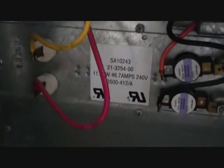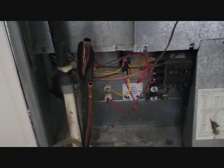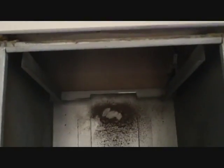What we have here is a Coleman electric furnace, 11 kW. You can match it up with a variety of outdoor units. What we're going to do here is match it up with a 3-ton Heil outdoor heat pump. We'll have heat pump heat, and basically use the strips like a heat pump would use for supplementary heat strips. Old copper lines are coming out, all the drains are coming out, it's all going to be replaced. About to put a new coil in — it's a Heil N coil.